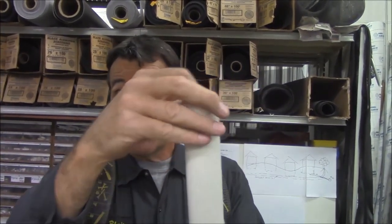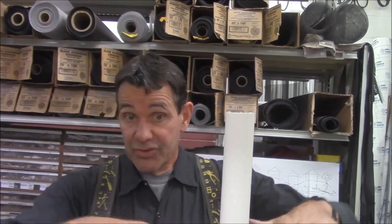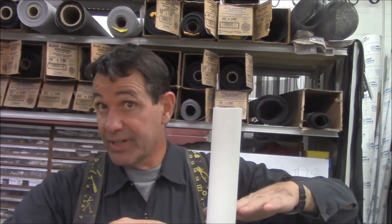It's going to rain — there's an external disaster coming our way. We take the floor drain cover off and screw in our standpipe. This is 1¼ pipe. You can't cap this; this has to be open to let the water in, so the damage doesn't come into the house. What happens is the water can raise up from the basement floor — it's coming from around the house or from the city sewer. It comes up 4 or 5 inches, the water will stabilize in here, and we won't get water in the house.